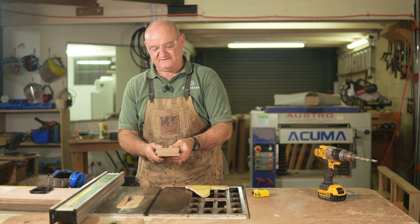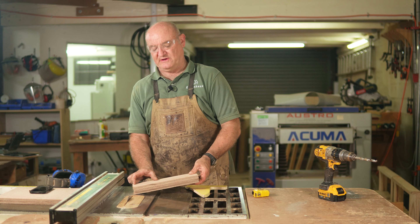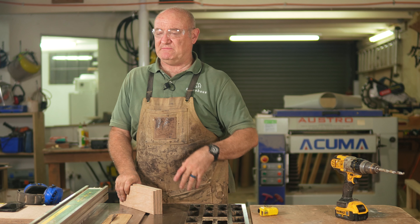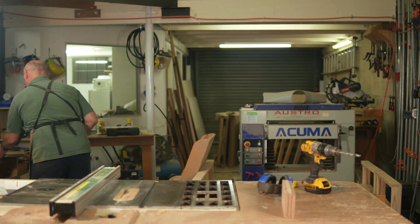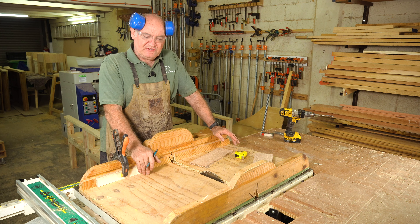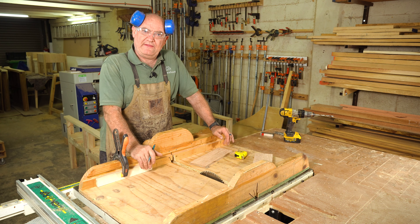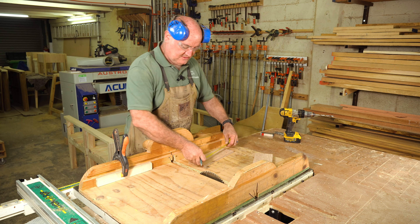A couple of things: when you're cutting plywood, it makes sense to not have your blade stick out way above your plywood. You actually want your blade to just be above the thickness of what you're cutting. Number one it's a lot safer, and number two less of your blade is traveling through the wood which means a cleaner, faster, better cut. Let's get our safety gear on and get cutting. That piece of wood in my hand is my push stick — it's a good idea to use a push stick when using a table saw to protect your fingers and keep your workpiece nice and flat.